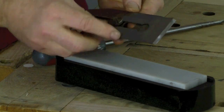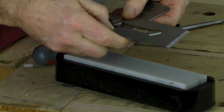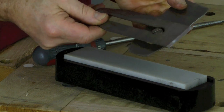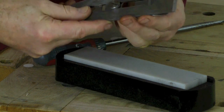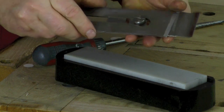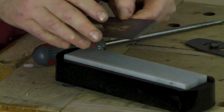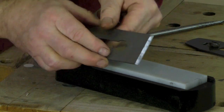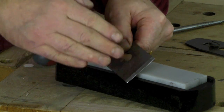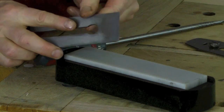To sharpen, you do need to take the chip breaker plate off. The best thing to do is just turn it to one side and pull it out like this. When you put it back, angle it so you don't bump the blade edge against the other edge. There's the plane blade — it's flat on one side and has a bevel on the other. You can make that hollow ground off the grinding wheel or you can come straight onto a sharpening stone.